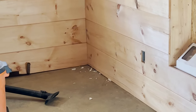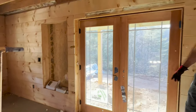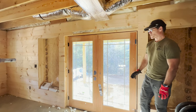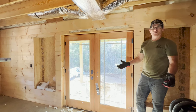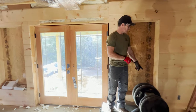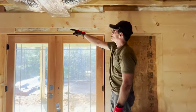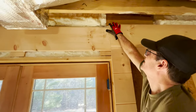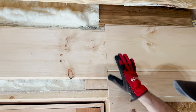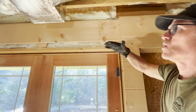We had to keep the lines, the tops of the boards, all matched up evenly. We had to rip this one as the first board and then work to the top. It all worked perfectly, but that was a month ago. So today we started out and just assumed we could start over here and work our way to the top. Coming across, you can see right here, we were a little taller and we were trying to figure out why, and all of a sudden I remembered we had shortened that board up on the bottom. So the whole wall was down just a little bit.